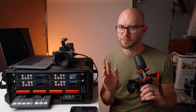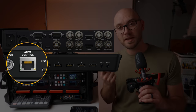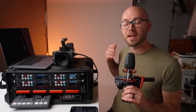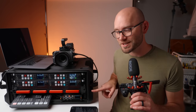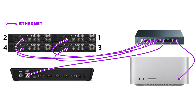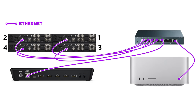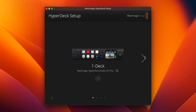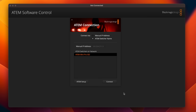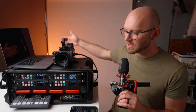Next is networking — not required, but really handy. Each of these recorders and the switcher are all from Blackmagic and have an ethernet jack; you can update, control, and change settings over that connection. Instead of running five ethernet cables out of the back of the case, I installed a small TP-Link 8-port ethernet switch inside the case, ran a short cable from each device to that switch, and then connected a single cable out to the back jack. From there, I run one ethernet cable to my computer and use Blackmagic software to pull up each deck and change settings — even adding LUTs for the ATEM Mini. Not necessary, but really nice.